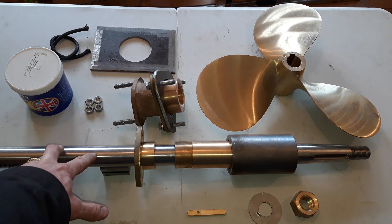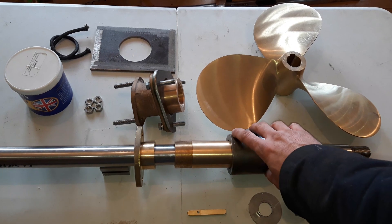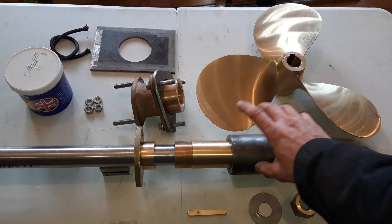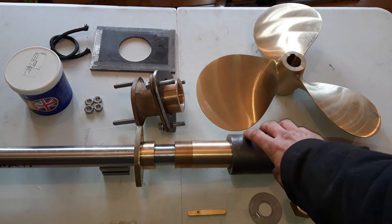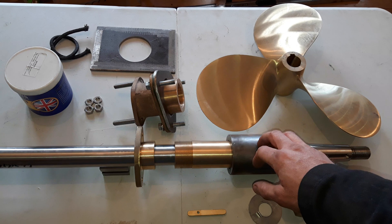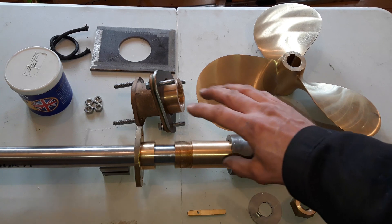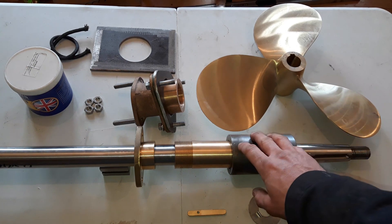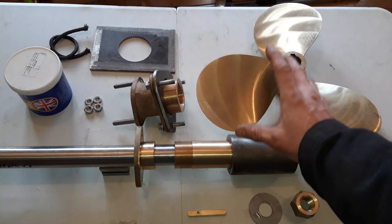This job is for a customer with an old-fashioned bolt-on boss on the boat. This steel boss is very common on boats — it's actually welded to the hull. The gentleman I'm working for has got a boss with bolts at 12 and 6 o'clock. They are prone to failing quite dramatically. He's already got water coming in and wants a complete change of system. The propeller is actually left-handed because he's got an older style engine and gearbox. The plan is to remove the old gear and weld the new system in place.